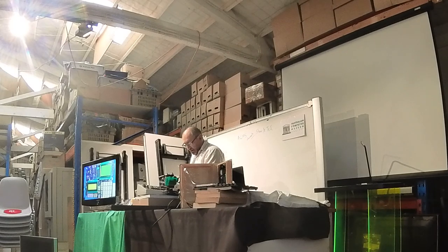Okay. And then we need to increment that B. So let's do 04, so increment B. And we need to now just jump back to 4,000, back to the start, basically. Or back to the load AB, which is 4,006. So I just do C3, so it's a jump. And I do 06 and 40.